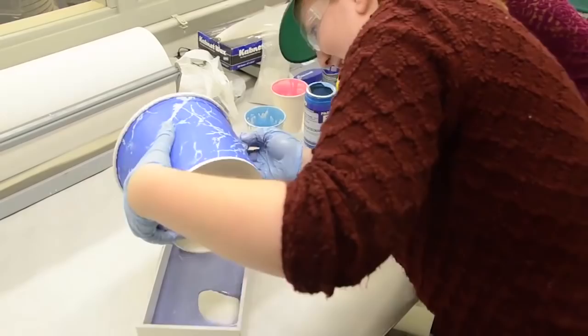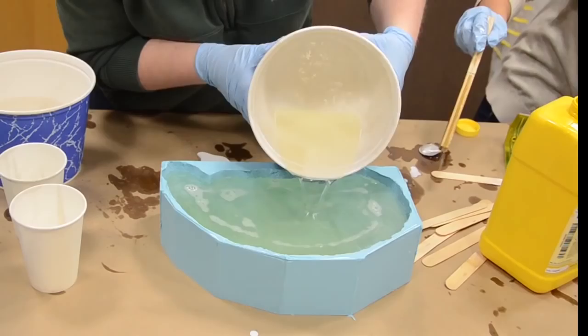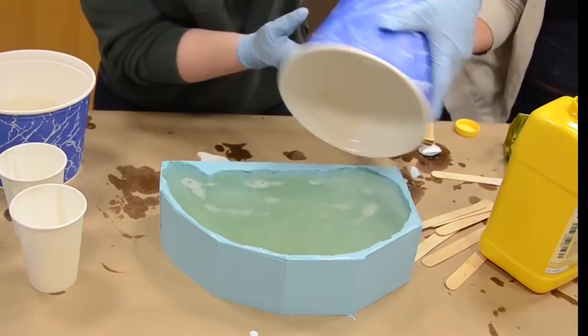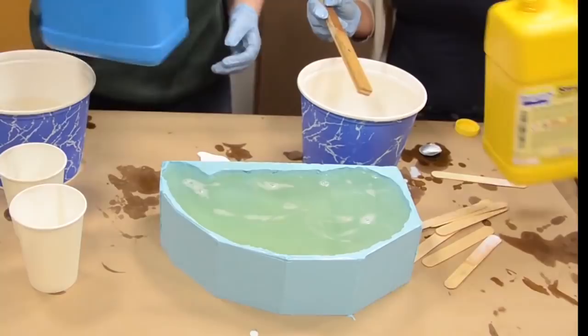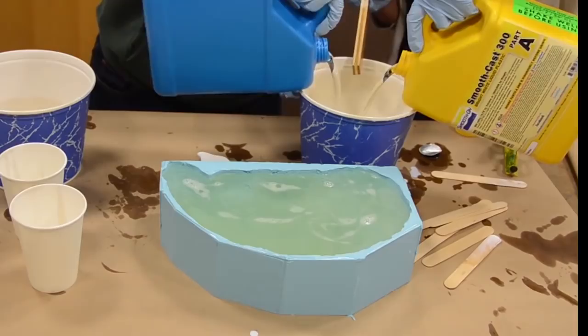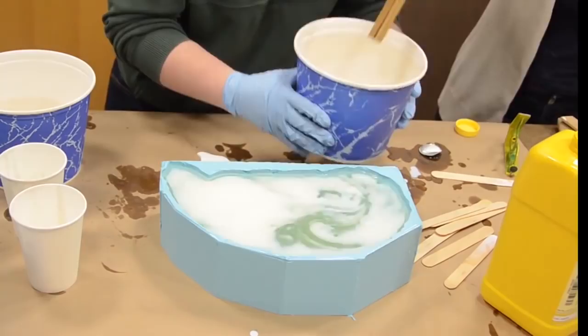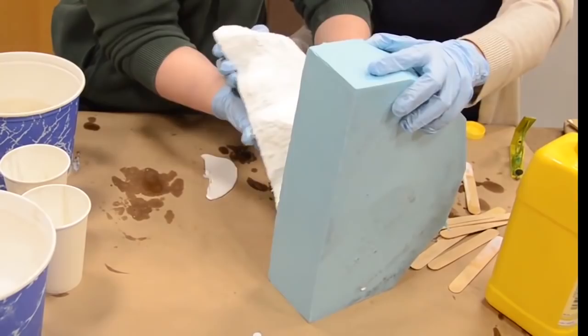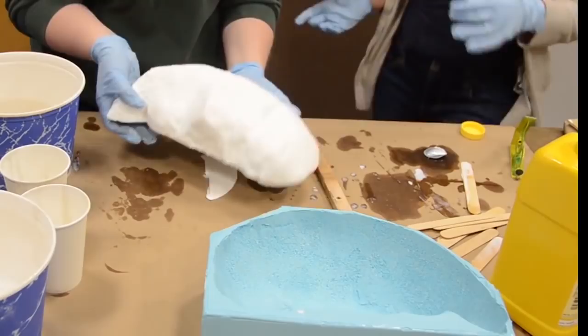To create robust, climbable holds with texture mimicking the real rock, we use a casting process on each of the two sets. This process starts by creating a negative mold made from flexible silicone. When finished, the mold is filled with low viscosity casting resin, which cures very quickly. The resulting hold is ready to be mounted on an indoor climbing wall.